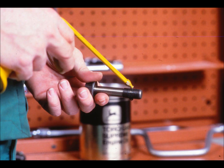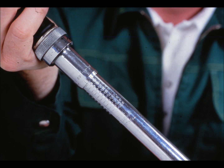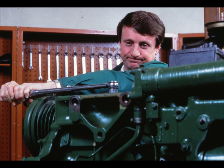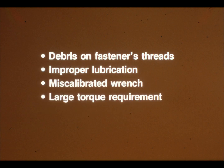This will make your torque measurement a more accurate indication of tension in the fastener. Not using the correct lubricant can cause problems too. If you use a lubricant that's more slippery than regular oil, like never-seize, you'll reduce the friction between the threads. Again, that changes the relationship between torque and tension — only in this case, you could stretch the fastener beyond its yield point before reaching the specified torque. Even if you clean and properly lubricate the threads, the torque method may still be inaccurate. Your torque wrench may not be giving you precise measurements, and torque wrenches must be recalibrated after frequent use. Also, it's hard to get an accurate torque measurement when you must apply a large force to the wrench. So, there are several reasons a torque wrench may not accurately measure tension: debris on the fastener's threads, improper lubrication, a miscalibrated wrench, or a large torque requirement.